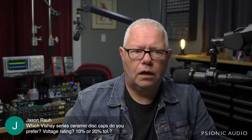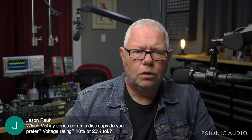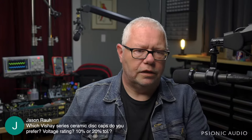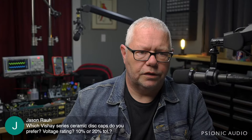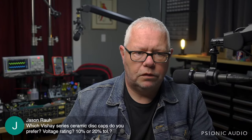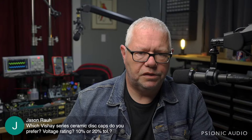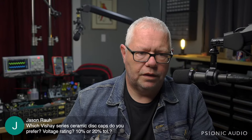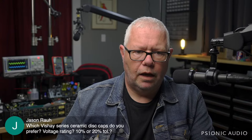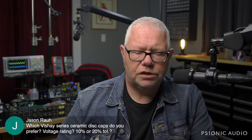Hey, Jason Raw, I apologize. I don't know how to pronounce your last name correctly. Which Vishay series ceramic disc caps do I prefer? I like the 562R series and the 561 and then a few others. I use 1 kilovolt whenever possible. I don't worry about the tolerance so much.